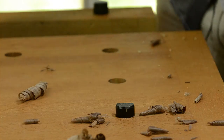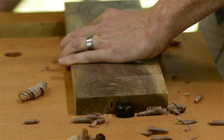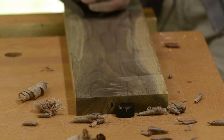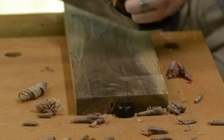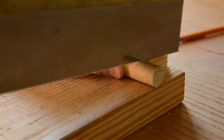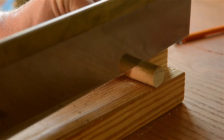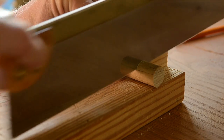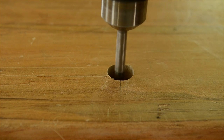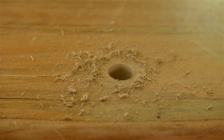Both shapes seem to work fine, however there is a slight danger of seriously chipping your hand plane's iron or blade if you're not careful, and that would cause you a lot of work to re-grind and re-hone the iron. So on all the workbenches that I've built I've made wooden bench dogs. I prefer round bench dogs primarily because I can just buy wooden dowels from the hardware store to make them — it's super easy. Also it's much easier to add round bench dog holes to your workbench than square holes, and you have to do that during the glue-up of the workbench top.